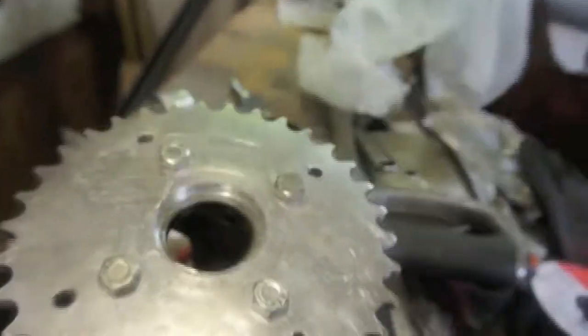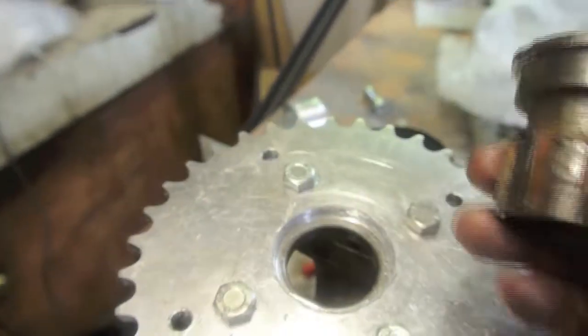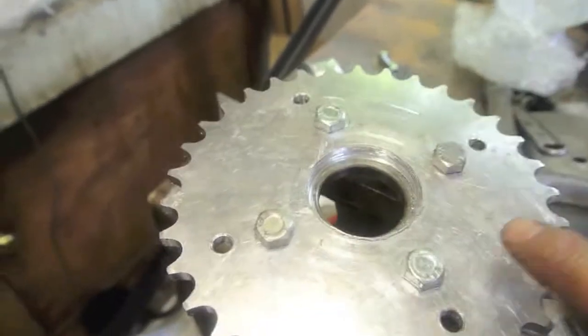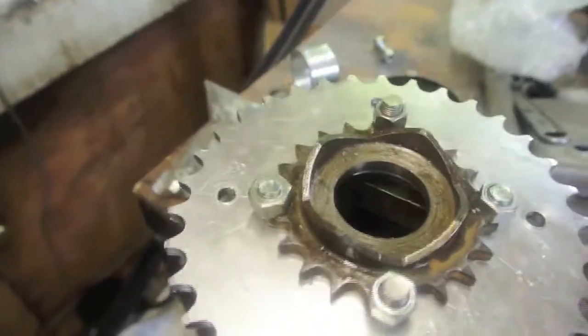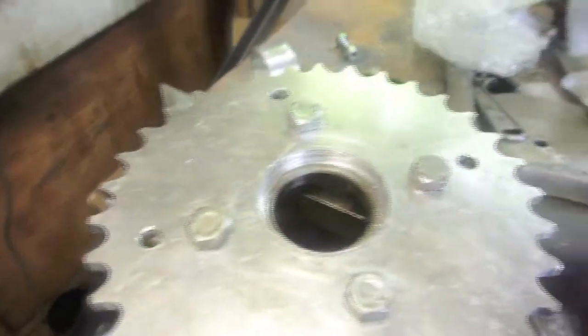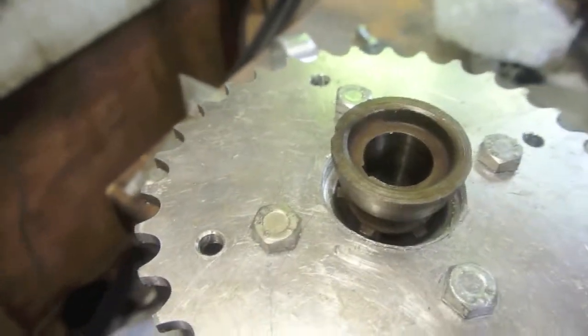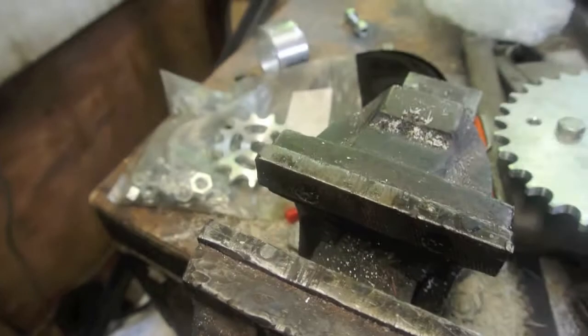Well, the hole that was required was much larger than I expected, because I forgot about the centre, which has to go in there. So I put this thing back in the lathe, gripped it in the 3 jaw just on this side, and carefully bored it out, and this fits in here. So that's pretty good. We'll get on, fit this onto the engine.